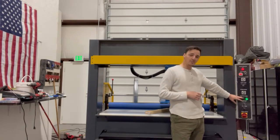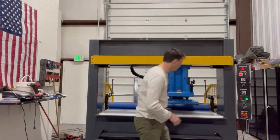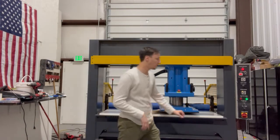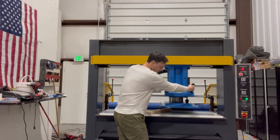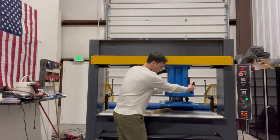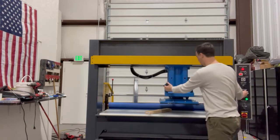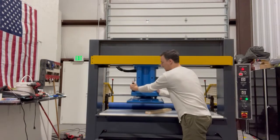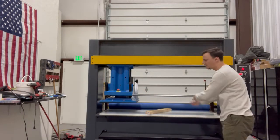Oil pump motor on and off — we've already talked about that, that's how you turn the machine on. The return height is how you determine how high the machine goes after a compression. So we'll do a compression and the head stays down low — I told it not to go up anywhere. Now I'll turn the return height all the way up and after a compression it goes up. So the return height is simply meant to make it so that you can make it go halfway up, do a compression, sidestep, sidestep, sidestep, and then you would come in and access all your material.